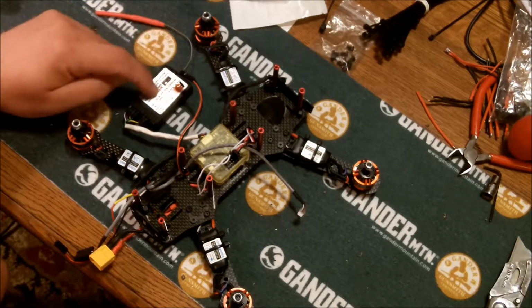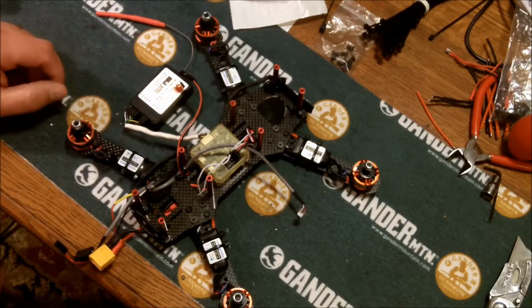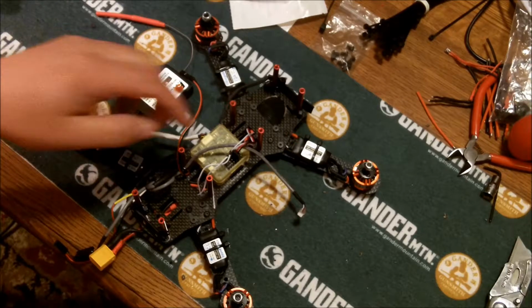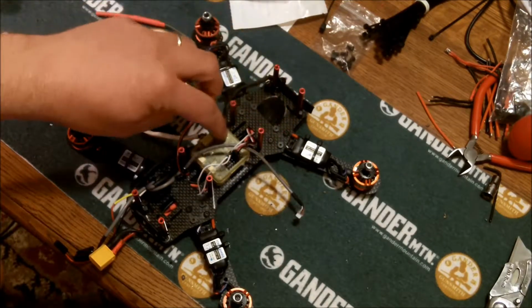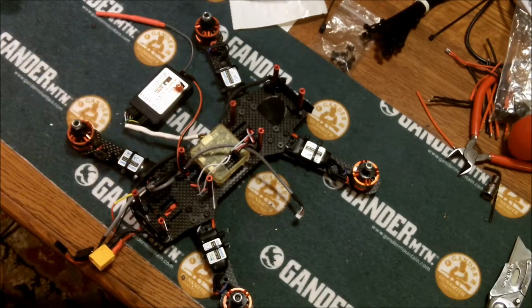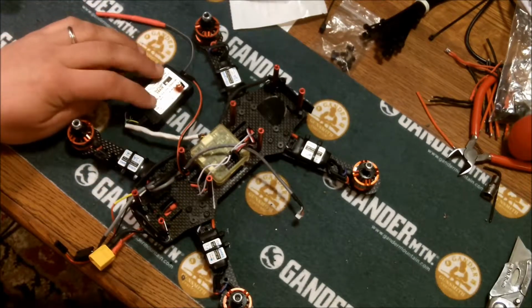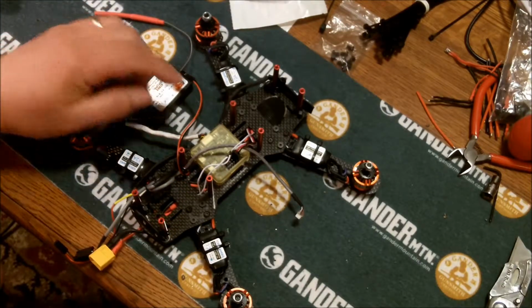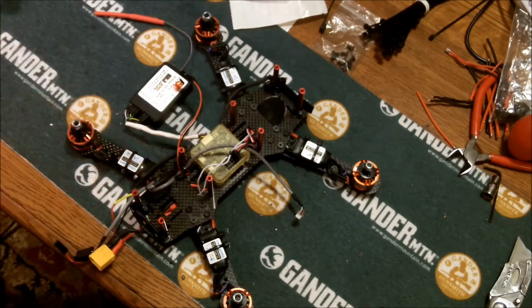So I connected my receiver and connected the board to OpenPilot. Had some issues there. My channel 1 for my ESCs is not working on this board, so I had to do a custom mix for channel 2, 3, 4, and 5, which I've done. And then I was having problems communicating from the receiver to the board, which I figured out was actually my fault because I wasn't rebooting the board every time I made a change on the program. So I've worked through that.